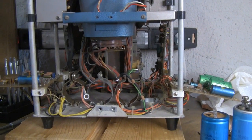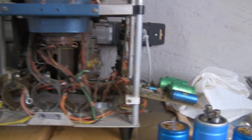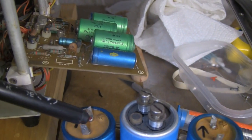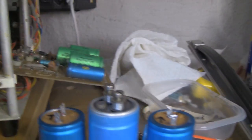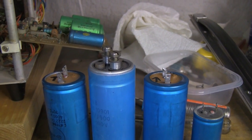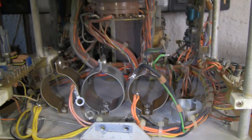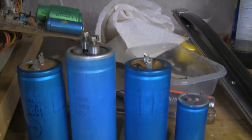Having got a proper mains connector all set up, I thought it's probably safest to rebuild the power supply. You may remember from the first clip, these capacitors have little bulges on them — which I think you can see here, and same over here. I decided I'd replace all the large electrolytic capacitors as a minimum. Since space is kind of at a premium in here, I need to take these out so I can measure them up physically, so that whatever replacements I order are going to fit properly into the space I have available. If the new ones are a different size, I'll have to replace these clamps as well with ones appropriate to the size of the replacements.